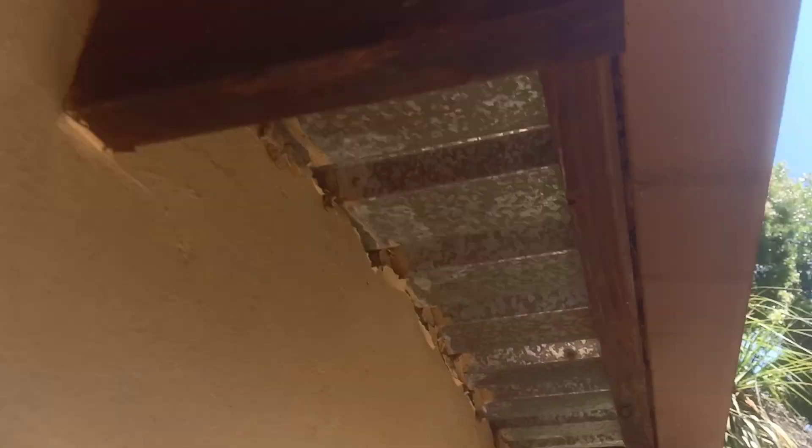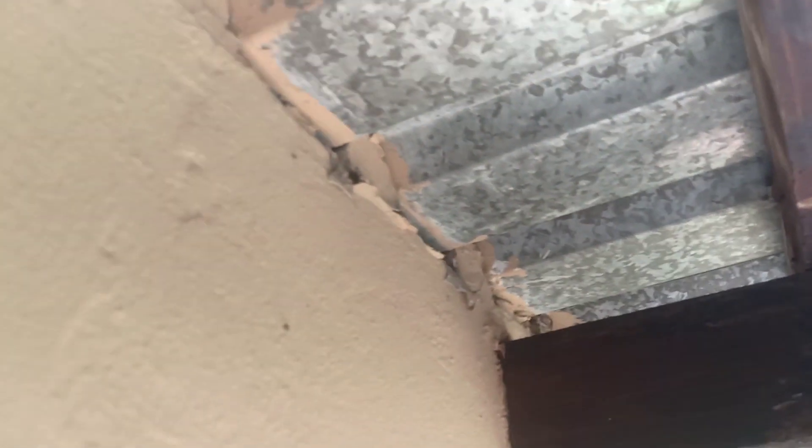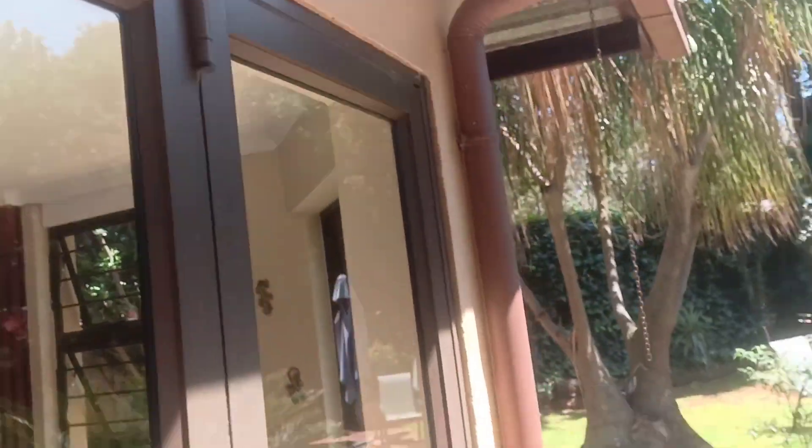This is the bottom end of the roof. You can see the plaster there is loose — there's definitely a lot of movement, expansion and contraction, and then the edges fail there. There's too much movement on this roof.